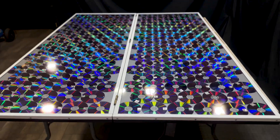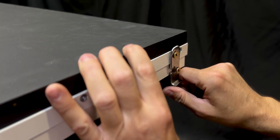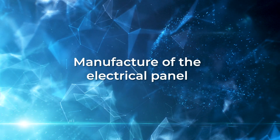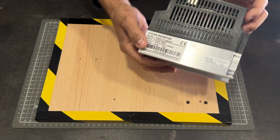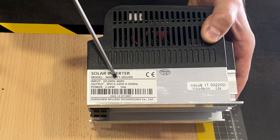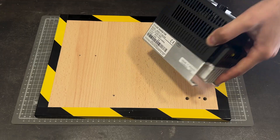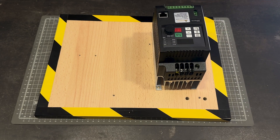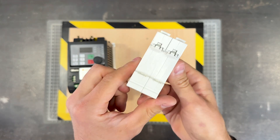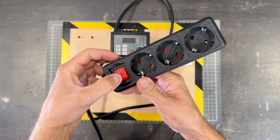The result is impressive. We have also made a safety lock that we screw on here — this way we can transport it without the risk of it opening. This device is a solar frequency inverter that transforms the current generated by the solar panels from 200 to 400 volts DC to 220 volts AC, like household outlets. The purchase link is in the video description. This is a 20-amp circuit breaker for direct current, used to power the solar inverter. And finally, a socket base. Let's mount it.